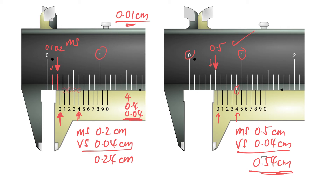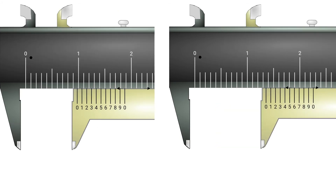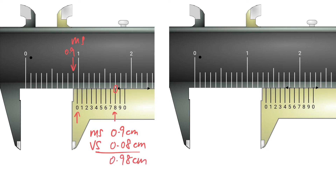An important note: the frame of the vernier scale is not important — do not look at that part. That is a common mistake. Always look at the zero of the vernier scale. In the next example, the zero of the vernier scale starts here, so the last main scale reading is 0.9 cm. The vernier scale shows the eighth division is in line, giving 0.08 cm. The final reading is 0.98 cm. Note that some vernier calipers label the last division as '10' instead.